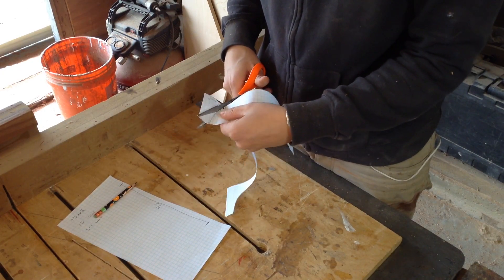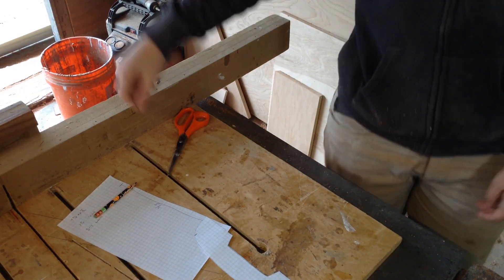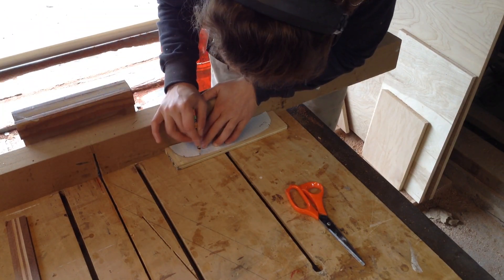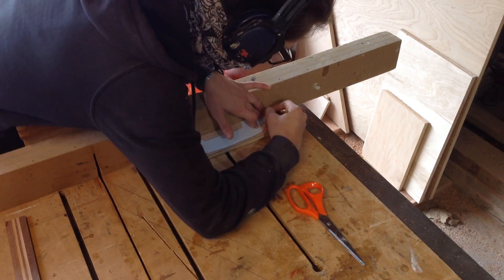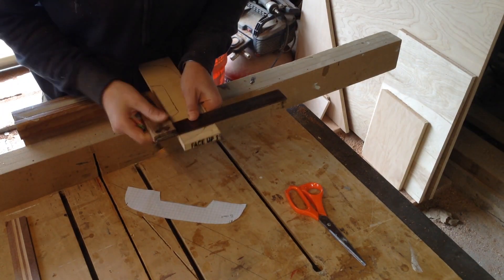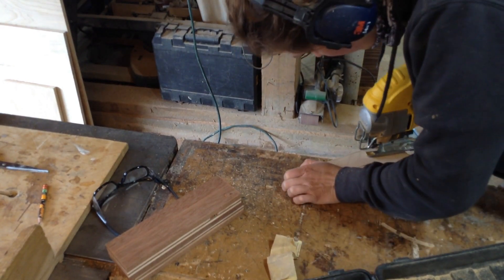This is the paper template I'm working off of. The marks I just made are where the screw holes are going to go. I ended up turning this into a plywood template so I can easily reproduce these without taking measurements every time he comes by. If you're going to be making multiples, I always recommend transferring to a wooden template. With a wooden template you can usually route out pieces — I didn't do that here because these were small enough that the table saw was easier — but it's still nice to have.